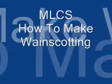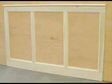MLCS would like to show you how easy it is to make wainscoting using our two-piece router bit set. Dimensions on this project will vary, so cut all your boards to length. Remember to leave extra length on your vertical boards for profile overlap.